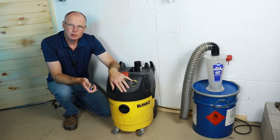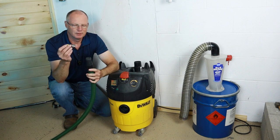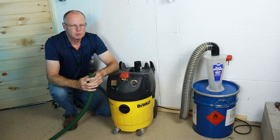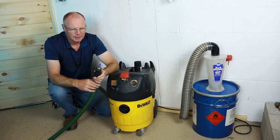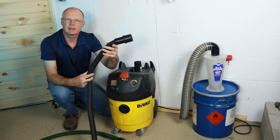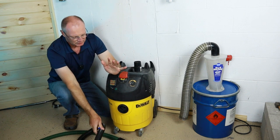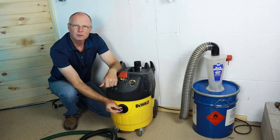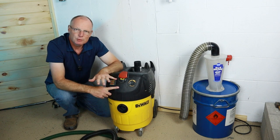The next tip I have for you, if you want to try your vacuum, the air hose right here, I made an adapter that is just a piece of steel that I machined, and it goes right in the front of it. And what I found, in hooking this up to the hose, is that my vacuum is greatly reduced, especially not so much on the hose from Festool, but way more on the hose from DeWalt, the standard hose that comes with it. The reason is that it leaks. It leaks right here, and it leaks also in the front. So if you want to try this, my tip for you is make an adapter that fits right in the front of your vacuum. And then plug that in here, and your vacuum hose goes then directly in here. And it can be, you know, a piece of wood with a seal or something fancier if you like, if you want to try it using this.